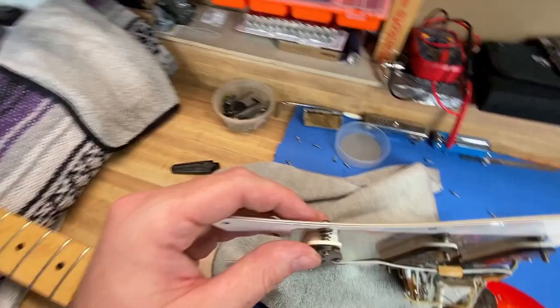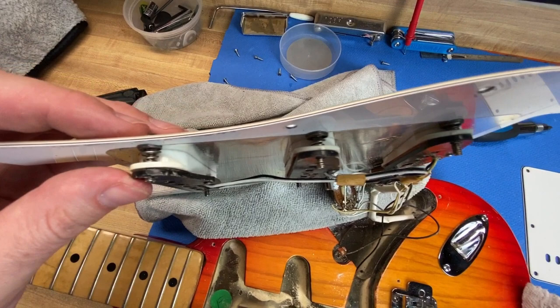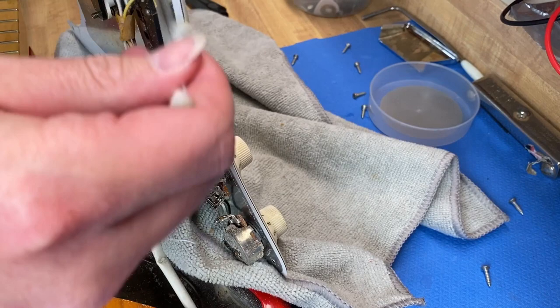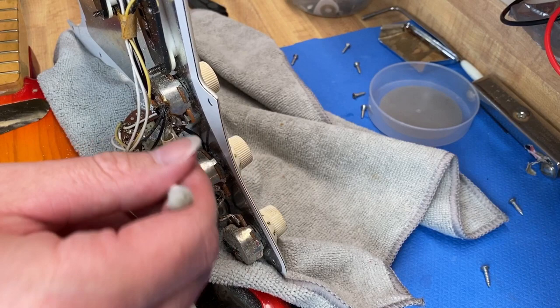All right, so now I've got that spring safely housed like its counterparts. It was just off to the side. I bet the manufacturer just did that wrong. That's so goofy. All right, so we're gonna get to work on some of this oxidation and just start brushing what I can away. And then definitely gonna need some contact cleaner because that oxidation is everywhere.